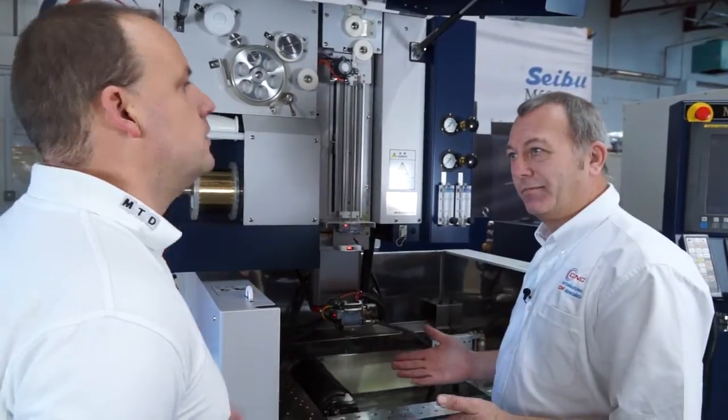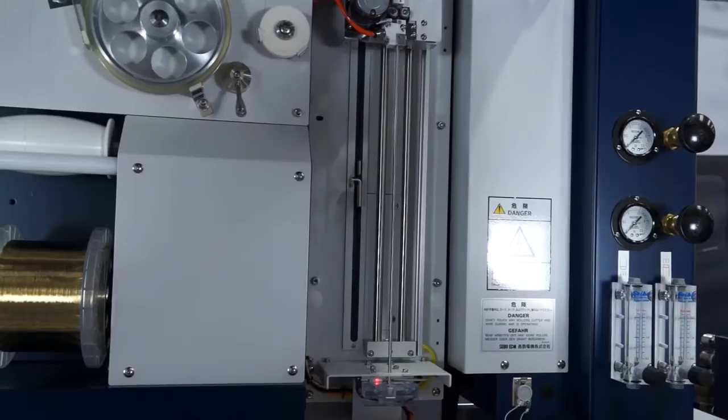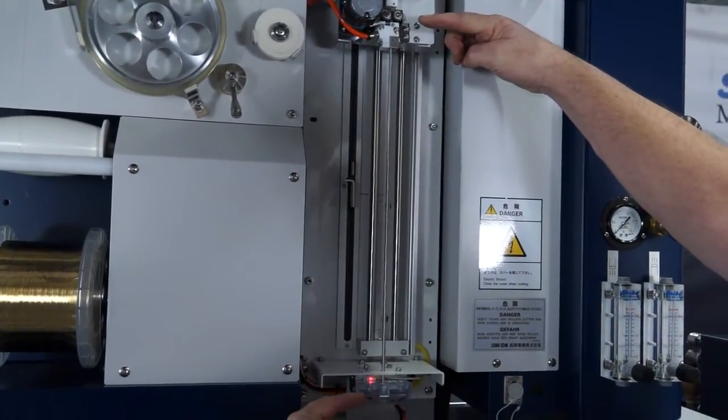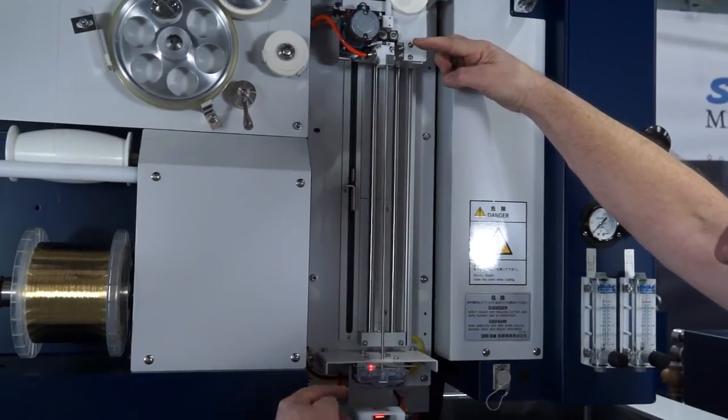What's the timing for doing these operations — is it quick if you break the wire? Seconds — very, very quick. When the wire cut operation starts, the wire is annealed to make it stiff, so when it's threaded it goes through nice and easily.